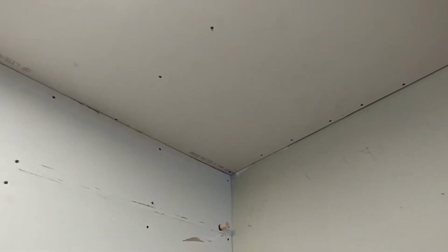Still got piping running right there. I actually found a wine bottle cork to plug it, just because. And I'm going to run a 2x6 brace with a 4x4 cross member along the top right in this area, so I can securely mount the heater without going beam to beam. When I do get that wired and hung up, it's going to go right there in that corner. That's what the piping is for right there, a little PVC chunk.